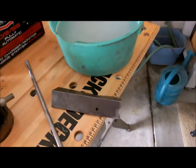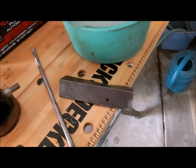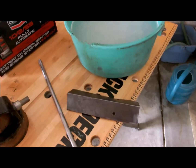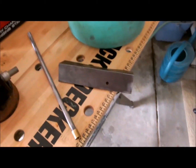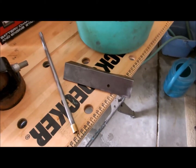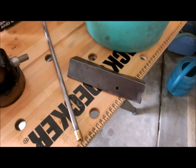There's a piece of angle iron that'll be our anode — that'll be the positive terminal of the battery charger, the DC current. The current will flow from the negative to the positive pole. The positive pole is where the rust will all collect. When we're finished, we'll have to throw this piece away because it's going to be completely ruined. But that's the price you pay to get the rust off of three or four of these old casters.